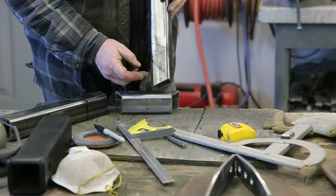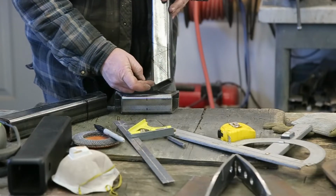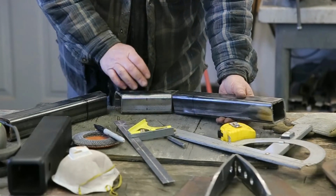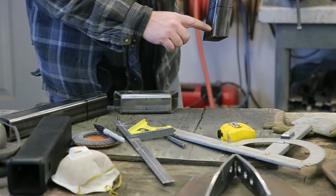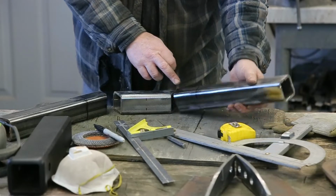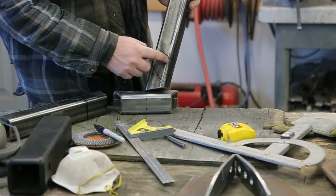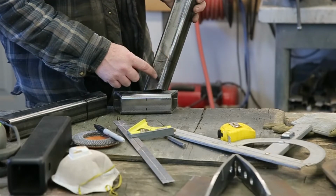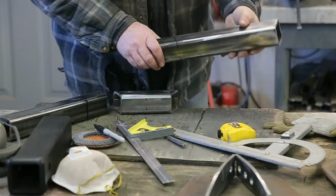There, you can see what I did here. I just measured up. You gotta make sure you don't measure straight up 2 inches this way. It's gotta be straight up and down. So that line there, I just drew a line from the bottom here, added an eighth, went 90 degrees to here, to 2 inches, actually 2 1/8 when it's all said and done. Gonna make my marks at 22 1/2, and I'll cut those.